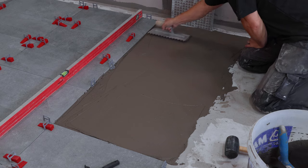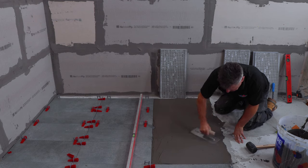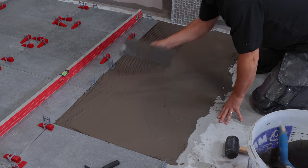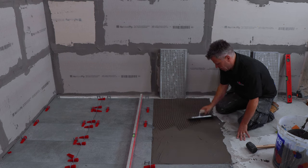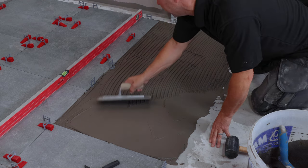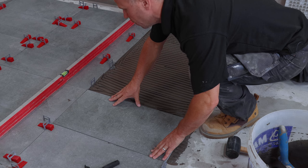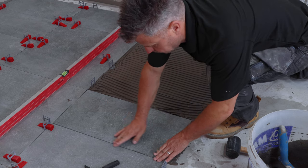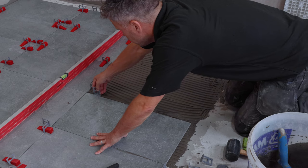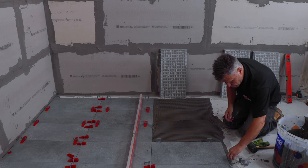Now when you're halfway through a large room like this you'll find yourself getting a little bit quicker each time. I'm now buttering up the floor to cover four tiles — I started off just doing one or two to start with, and then as you work your way through you put a little bit more down because you get better and quicker at it. Now you may have noticed that I haven't put any base clips in that centre tile — that's because I went for a cup of tea and the rapid set reacted and went hard, so I couldn't slide them under. Always remember when you finish off a course, if you're remixing adhesive or even having a cup of tea, slide your base clips in place first.